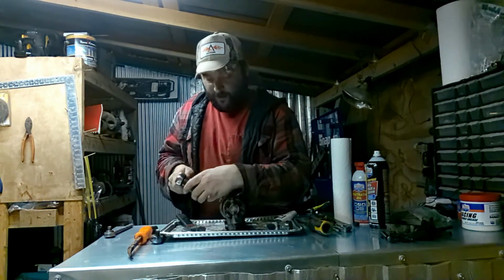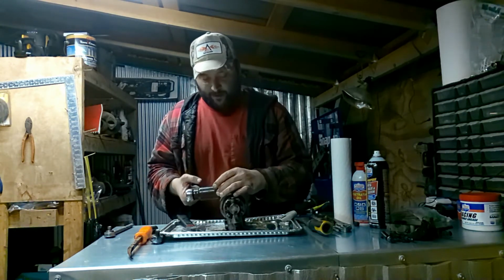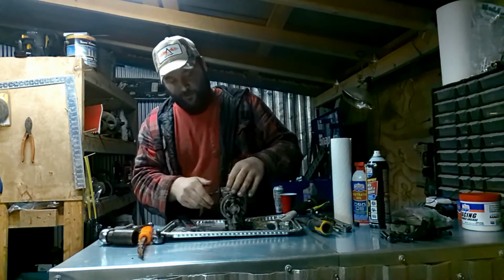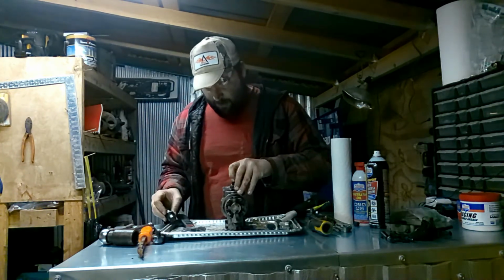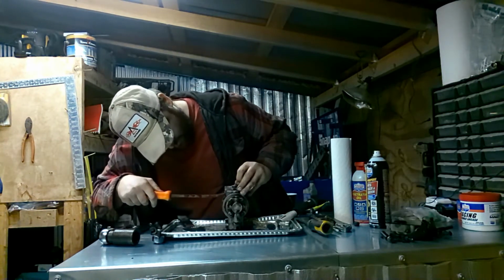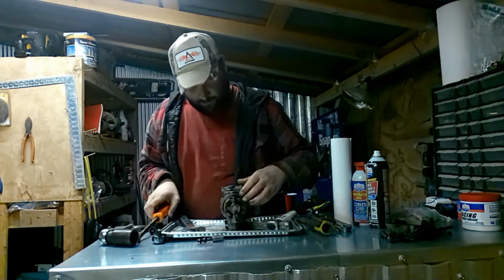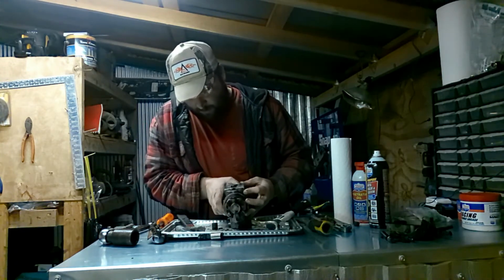Yeah, take that. What I got here, well, it's a 30 millimeter, so it's probably about an inch and an eighth for this pump here. And it should help you drive that out. Gotta be cautious because there are springs on the plungers, and there's also these little tappets in here. And all that came out.